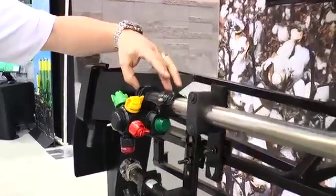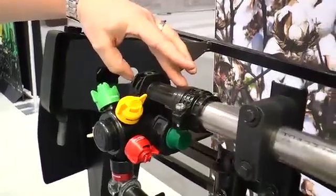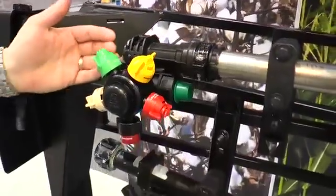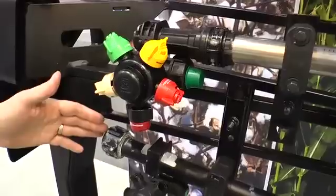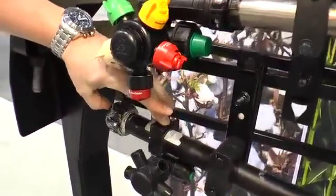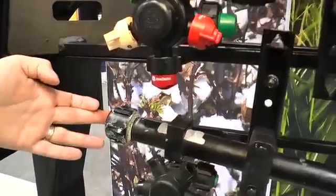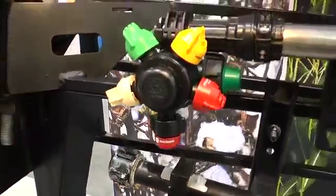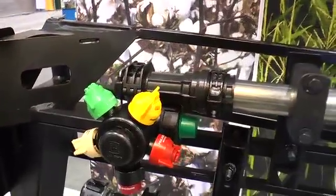This upgrade can be made on any of our John Deere machines that don't have the new end cap aspirators found on the four series sprayers — a really nice upgrade. Contrast that with the polyplumbing over here and you can see this dead zone. After that last nozzle body on that spray pipe, you can have a dead zone that will very easily build up contamination of chemical and make it difficult to clean out.